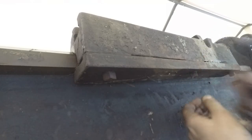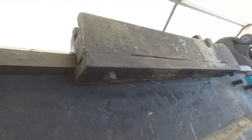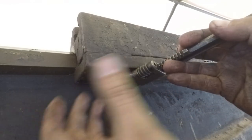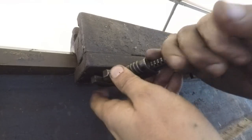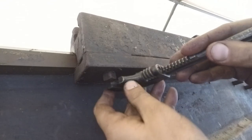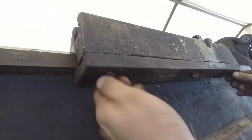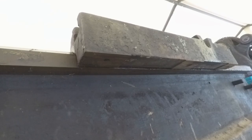I really don't see how the gib is adjusted unless there's a screw in the end. If it's a tapered gib I don't see it - interesting. I guess all the play is controlled by the pyramid ways up here, which keeps it from getting out of hand. It came out of there pretty easy - a lot of crud inside.